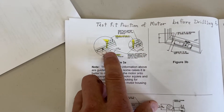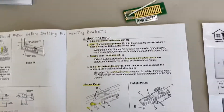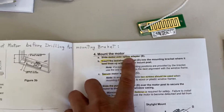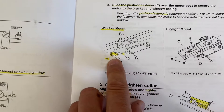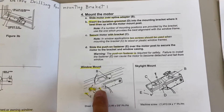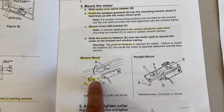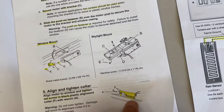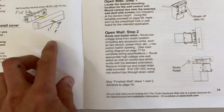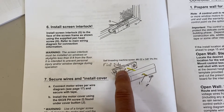You're going to want to drill for the brackets. This diagram is for casement and awning windows — both of those will crank. You want to slide the motor over the spline of the window, then add the bracket to the end of the motor. Put the rubber grommet into the holes that fit the shape of your window frame — it has variable holes to try. Finally, slide the motor over the splines again and place the motor against the window frame with its bracket. After you have the motor on, you can put the cover on — note that the motor side goes toward the window frame and the flat side faces out toward you.